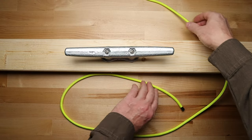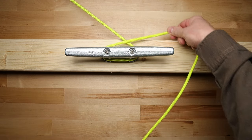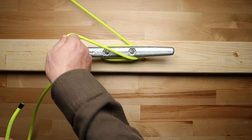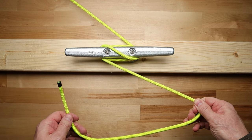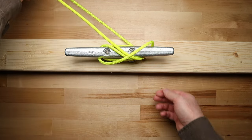The next version is exactly like the previous one, except you will do a minimum of two full wraps around the cleat. This is the most secure method, but will take longer to tie and untie and may bind with heavy tension on the line. You will want to use this method if you're using a small diameter line on a large cleat.